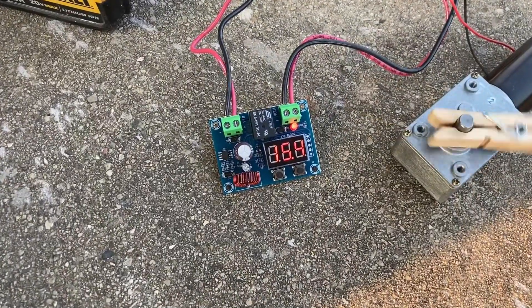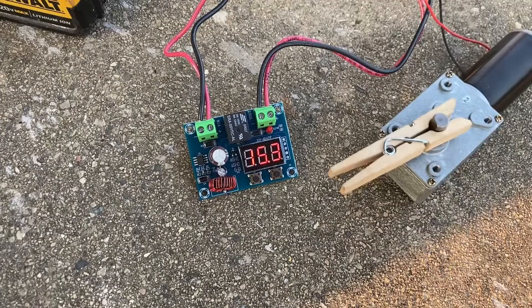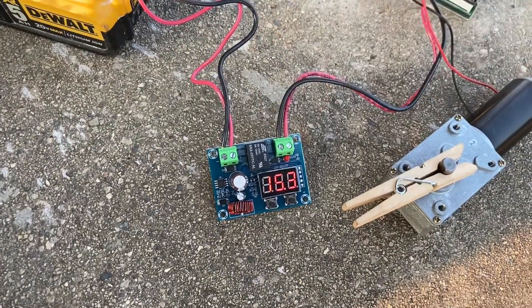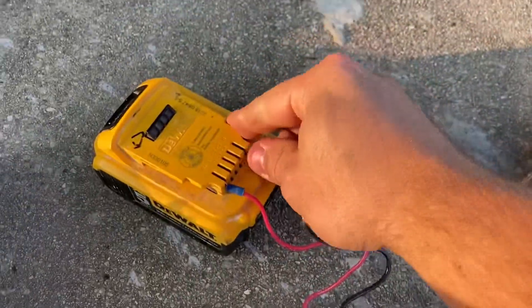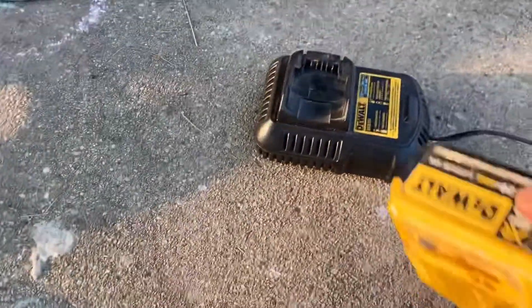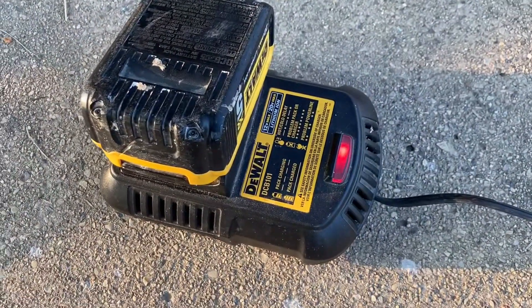This part took a really, really long time. Here we are draining right down to the last tenth of a volt — and there it goes. You can see the LED indicator clicks off. Our battery has hit 15.3 volts and the circuit has protected it. Here's the test: can it still be charged? And there you have it folks.